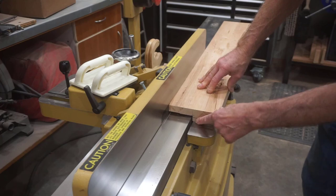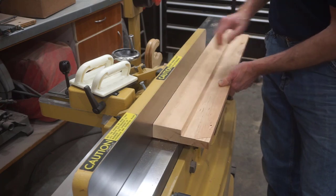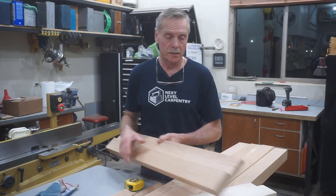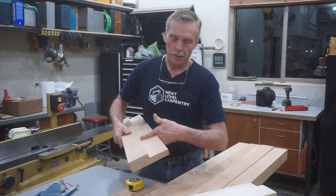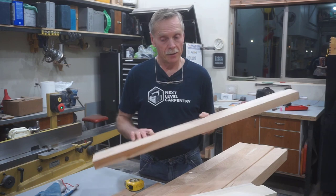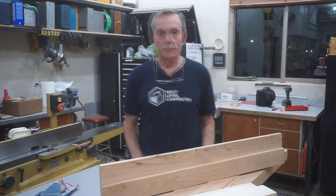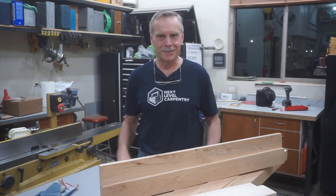So I'm not able to use this process in the sequence to mill the face of this jamb 1/16 inch off. So this predicament tells me two things. One is I need to come up with a different plan for the rest of the jambs, and the other one is I created extra work for myself because I'm going to have to cut this face carefully with a table saw. That's the only way I have to get in here and clean this up, and then I'm going to have to sand and scrape all those saw blade marks out of there. Well, the good thing is I only have to do it to the head jamb, and I'll come up with plan B and a new sequence for the two legs of the jamb. I guess it justifies what's been said. As a carpenter, you're only as good as the mistakes you can fix. Let's see how good I am.